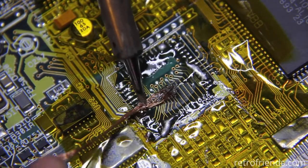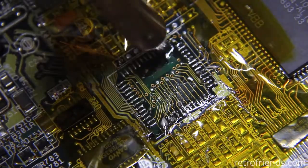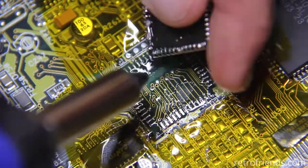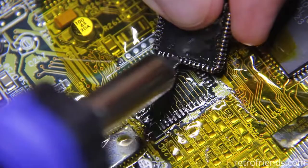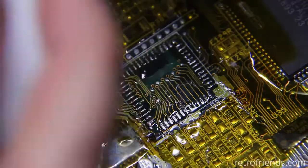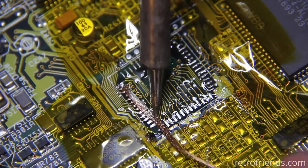Now we just need to clean off the pads. Here I'm using solder wick — it works pretty well. A faster alternative would be to use a solder sucker if you have one. As long as we have it out and warmed up, let's also remove some of the excess solder from the chip. We're going to go over the pads one last time with solder braid, being careful not to drag it along the pads with any force — we don't want to rip them up.